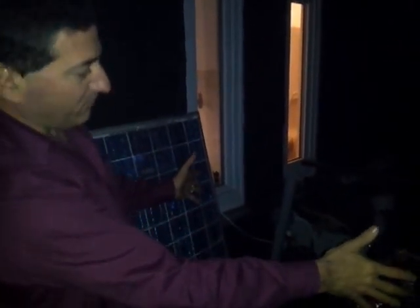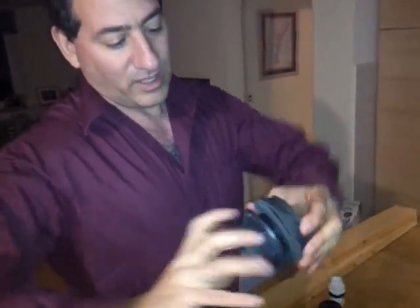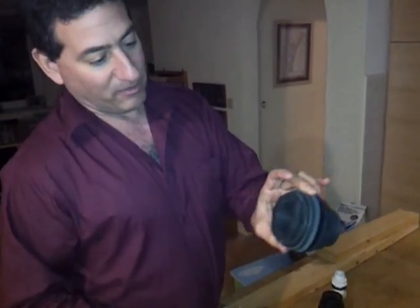Five tanks, just like this, would give you about a half an hour of cooking gas every day if you fed them actively. To pipe them together, the only problem is the expense of the tank fittings. This bulkhead fitting here, which clamps between the tanks so you can put the feeding pipes on, costs about 40 euro.